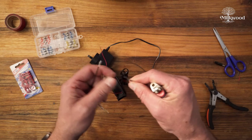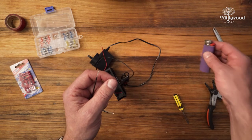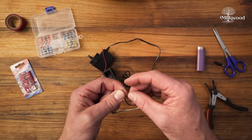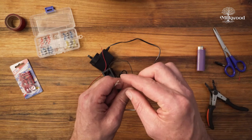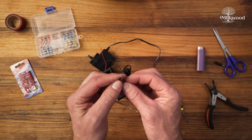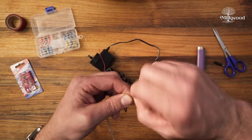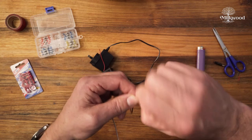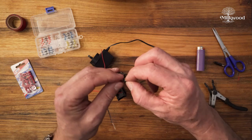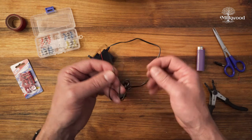Today, let's assume you've just got things you might have from a normal hardware store or lying around the house. We're going to join these together just by twisting them — for this kind of application that's actually fine. The best way is to start with the wires fanned out a little bit, place them together, interlock them slightly, and then using your fingers just twist and twist until they're all nice and tight. That's not going to handle much mechanical force, so you don't want to pull it apart. Also, at this point the wires are exposed, so if power was connected they could short out and create a spark that might damage your power supply unit.